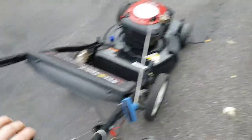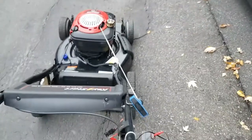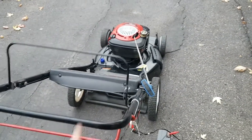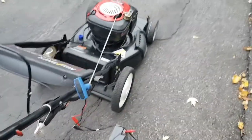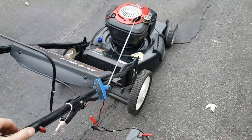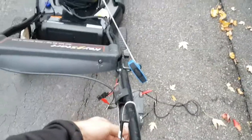Anyway, I'll show you how it works — it's quite nice, it works very well. You pull down the bail brake and then you just turn this key here and it should start. There's a little bit of trouble there because my battery is a little weak. It takes about 35 amps peak current — I put an amp meter on there and it peaks out at about 35 amps, and you need at least that to start it.